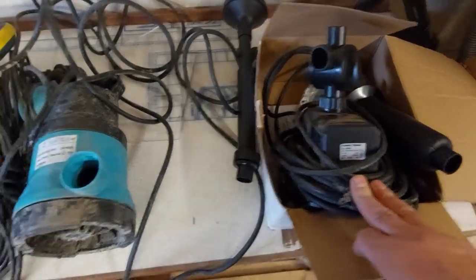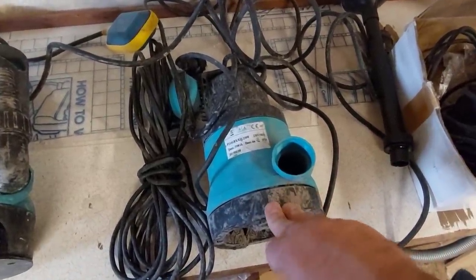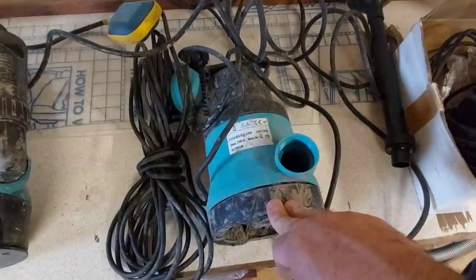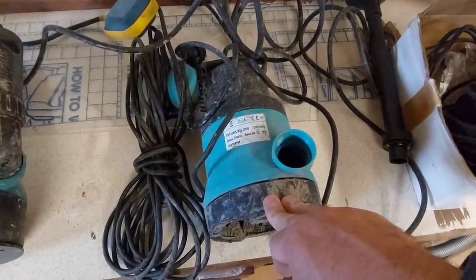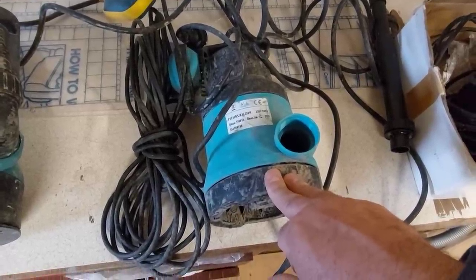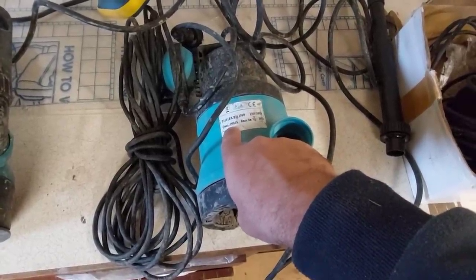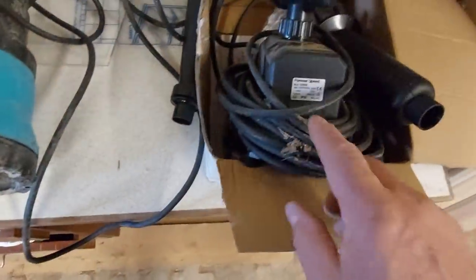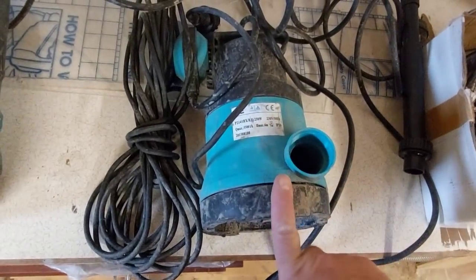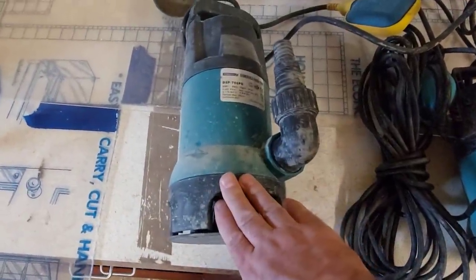I simply don't think that one's going to have the pressure or flow we need. I thought, why not try a submersible pump? They're good for constant running and won't have to do much hard work — it'll be pushing water out virtually as soon as it receives it, going up a couple of meters. I've got this one which I've had for years but I haven't had great success with — it forever blocks up. It's rated at 5,500 litres per hour, 250 watts. Then this one I found in the barn — I've run it up and it works.